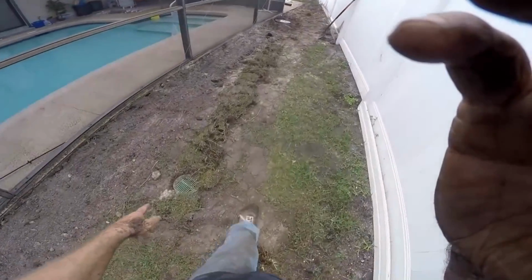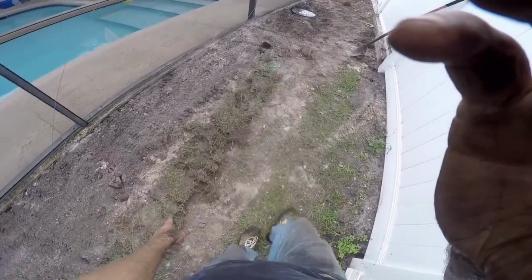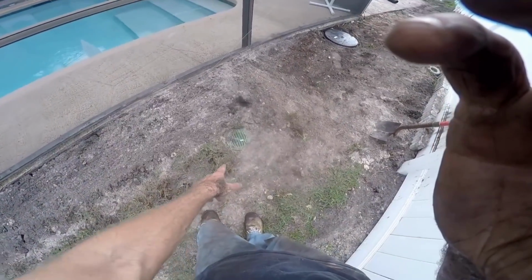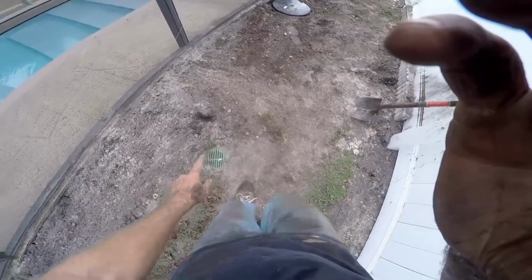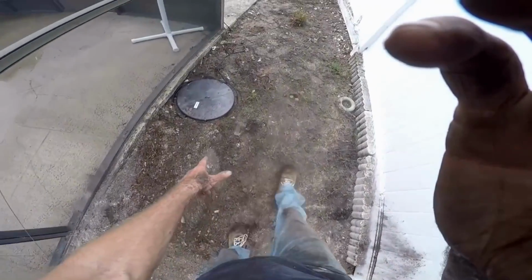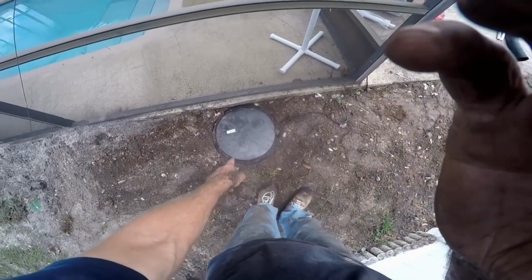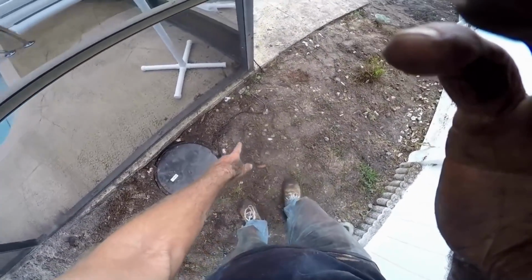So, little catch basin, that's for the surface water. Then we've got gravel perforated pipe underneath that sod. That's the French drain. That collects the subsurface water. Another catch basin to help pick it up. Solid pipe into our sump pit. Remember, we've got a Zoller M53 down in that pit. You can see the cord coming out.